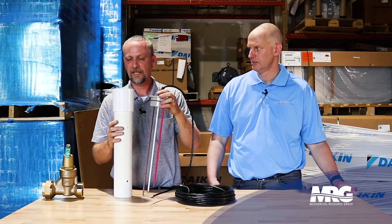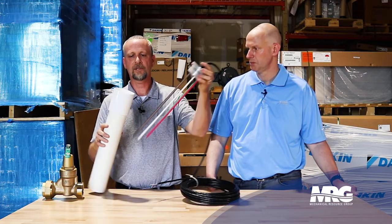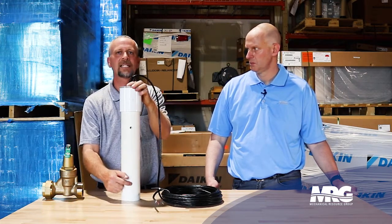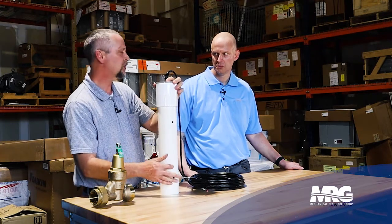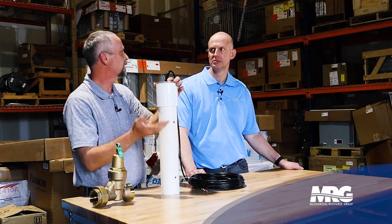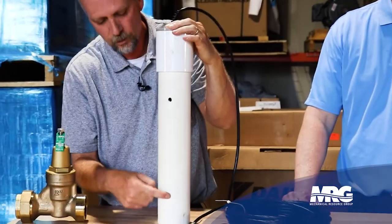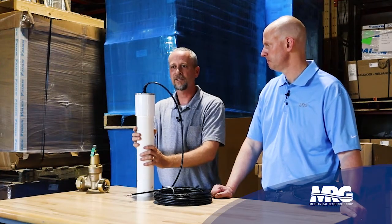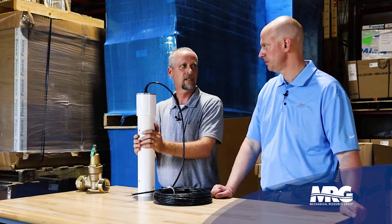The best feature about this one is you can mount it in the basin of the tower itself. U-bolt brackets come with it — just U-bolt around it and a flat plate bracket bolts to the side of the tower inside so the standpipe sits submerged. The bottom hole is ideally where you want your water level to be, and the top hole is a vent so air can escape and let the water level move up and down inside the pipe. Since this sits inside the basin, the water already has freeze protection from the basin heater — you don't have to run any extra power or heat trace. It's protected as long as that basin heater is active.